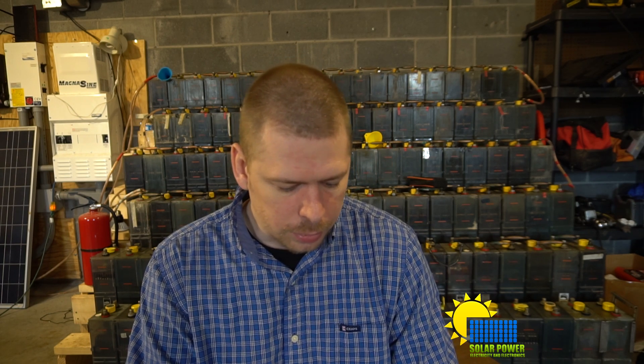Using more than two or three parallel strings without a common bus bar is another issue. You can put a positive and negative bus bar across your battery bank and tie your parallel strings into that. If you've got six 12-volt battery banks running in parallel, it will kill your batteries because one side gets heavily charged and loses a ton of water while the other side barely gets charged. You should be able to put the same amount of water in all battery cells every month. Use equal-length cables and bus bars.